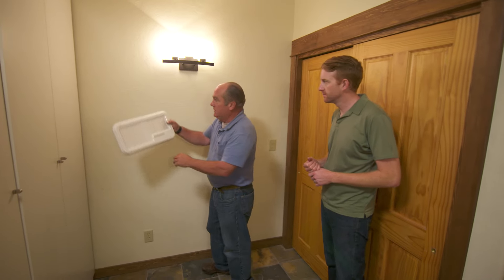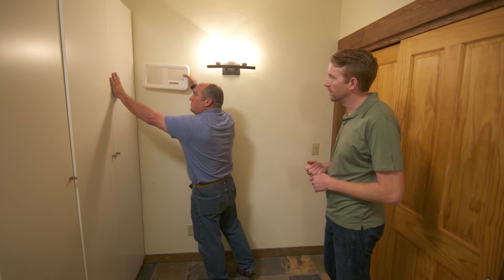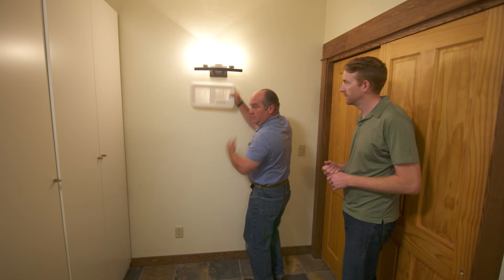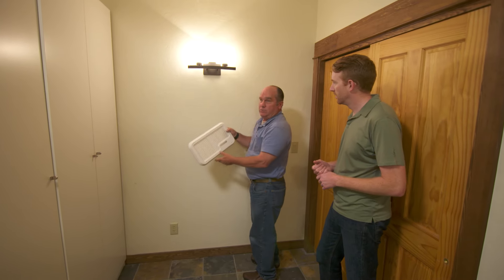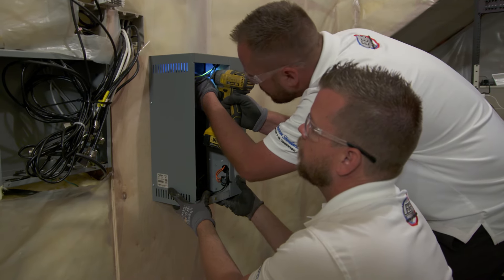But if I put this onto the wall here, the humidity would be highly concentrated and I'd worry about too much humidity coming onto these surfaces and causing mold. There is a prohibition about where you place it: it's two-foot clearance from side to side, five feet up, and a foot and a half down. Guess where the perfect location in your entire house is? It's right where this light is. What do you think of this light? It's not great. We can move it. That's the perfect answer.